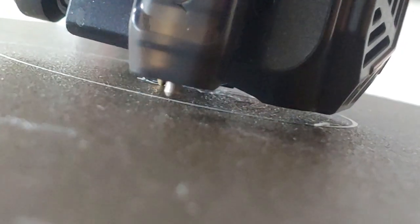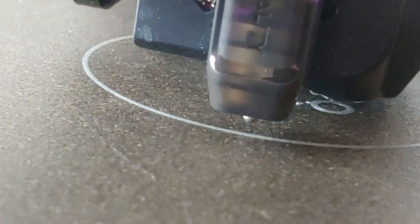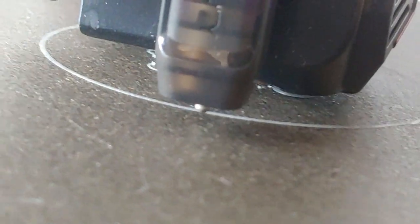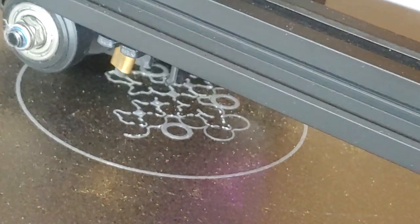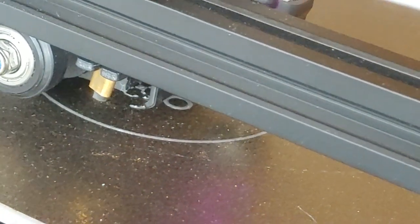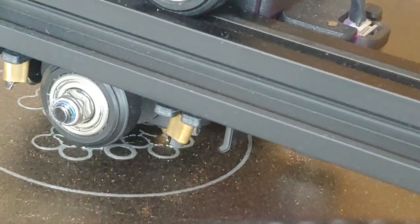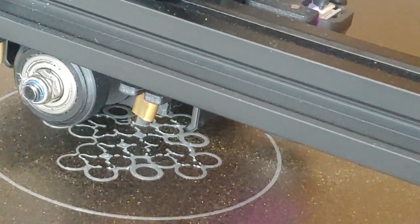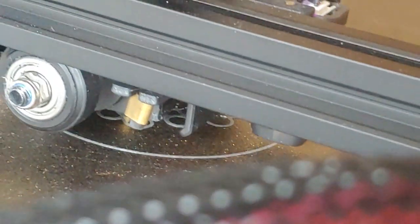It left a little gloop at the very beginning but it looks like it's sticking well to the bed. There's a little bit of skipping on the first layer — that's a little concerning, maybe I should have done the automatic bed leveling. See how it skipped a little on the first layer? Sometimes that problem takes care of itself if you let it go to the second layer — just watch it. Yeah, it smoothed it out. Maybe the nozzle was too far down and couldn't squirt anything out on those first-layer spaces.